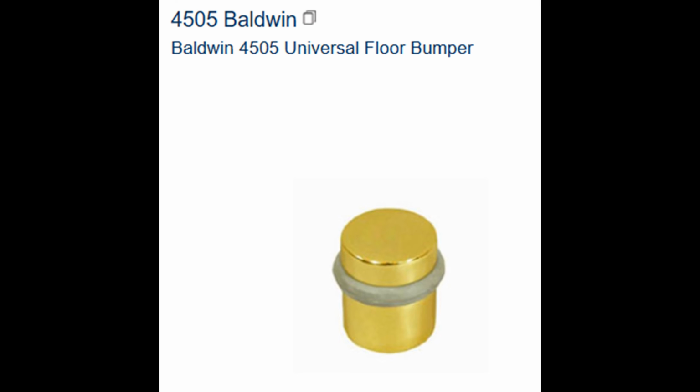I'd give the person spending the money all the options, and I would put a piece of masking tape on that drill point before you start drilling, right at the right dimension. Measure off a half inch or whatever. Put a piece of masking tape around the circumference of the drill bit, and you know when to stop. Or I mark it with a Sharpie or something like that. Or your idea is good too.